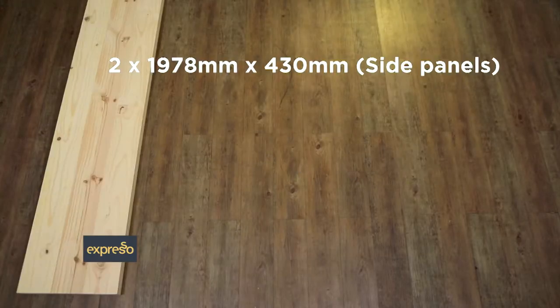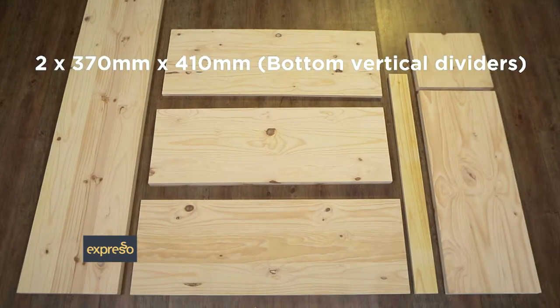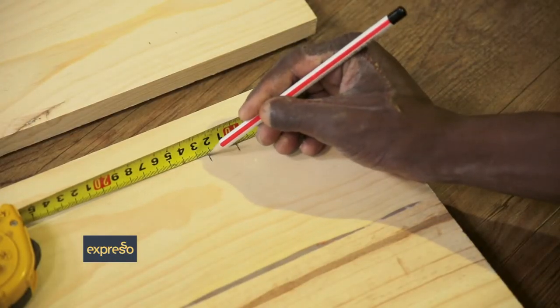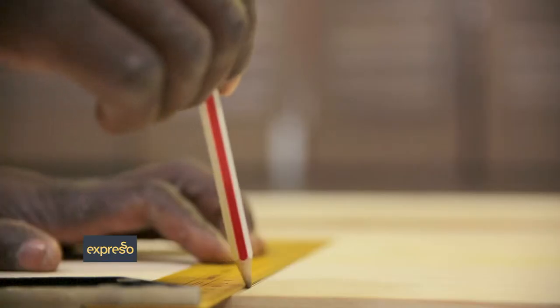To start your DIY project, you will need your design instructions, building materials, and tools close by. Lay your panels flat and use a pencil, measuring tape, and straight ruler to mark out where the floor, shelves, and top will go on each side panel. Measure all the way across your panels so that when you do the assembly, you can place the shelf exactly over the pencil lines.